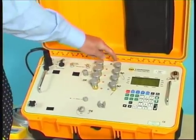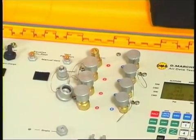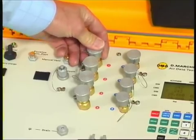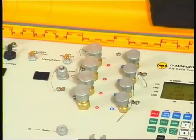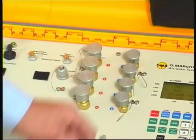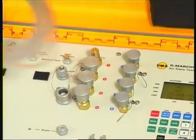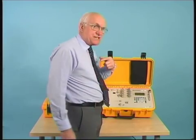Moving across, we have the actual outputs for the pitot and static connections to the aircraft. The instrument as standard has just two connections — one static, one pitot — but as an option you can elect to have multiple outlets. On this instrument we have the maximum available: four statics and four pitots, or if you like, four altitude and four airspeed connections. Each one consists of a quick-release coupling, so you can connect very quickly onto the fitting and through to your pitot-static adapters.